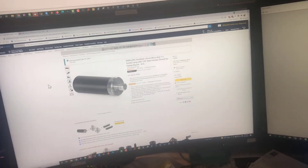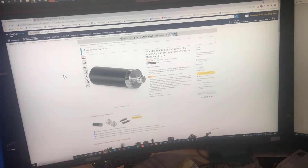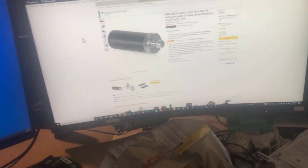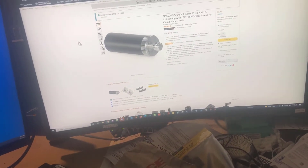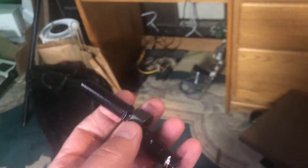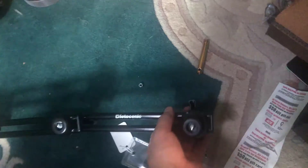The way I solved extending these Manfrotto clips so that they could get a screw mount on both ends is I took the end that had just the stud and I removed that stud — this guy right here. I unscrewed and took both of these posts off, which came with this fitting. I end up with just this round fitting.